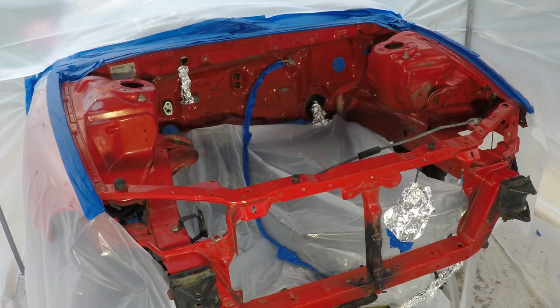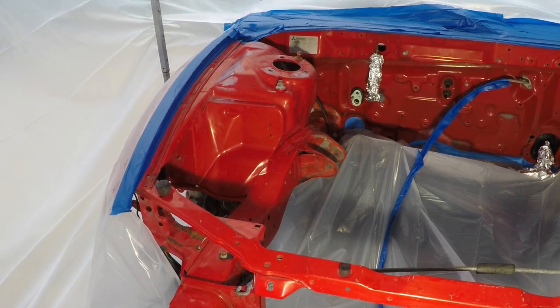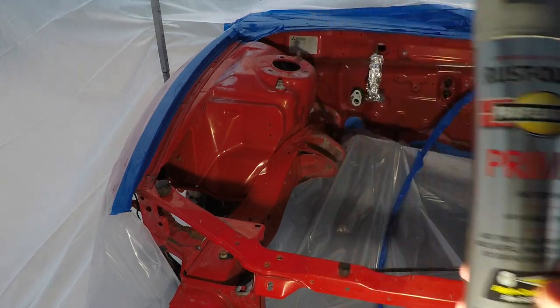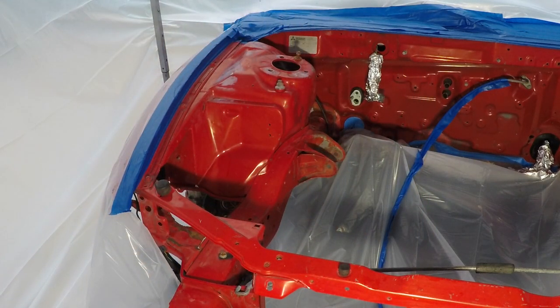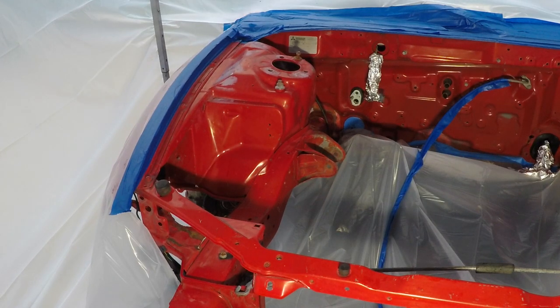What's going on guys, so today it's the same day — I just got done editing but it's super nice out right now, so I figured I'm gonna take advantage of it and spray primer on this. Let's get the seams covered on this side first. I was going to use this two-in-one filler sandable stuff, but I'm gonna be honest — I don't feel like sanding this thing. I'm gonna wipe down the surface one last time with acetone, just in case there's any spots of water.